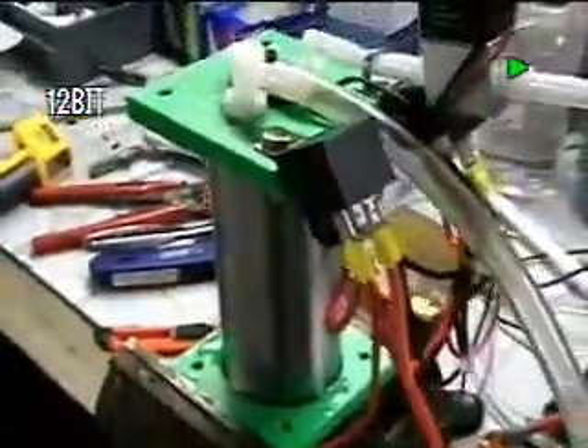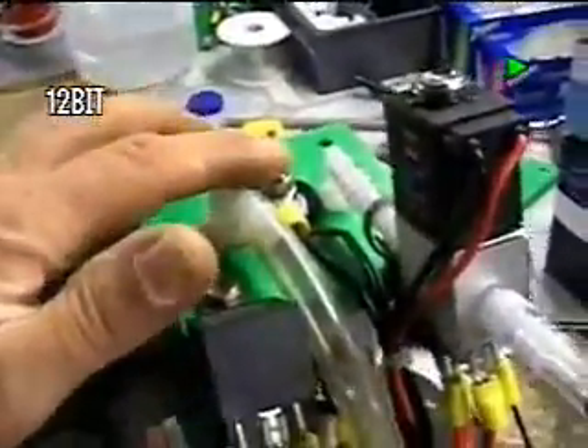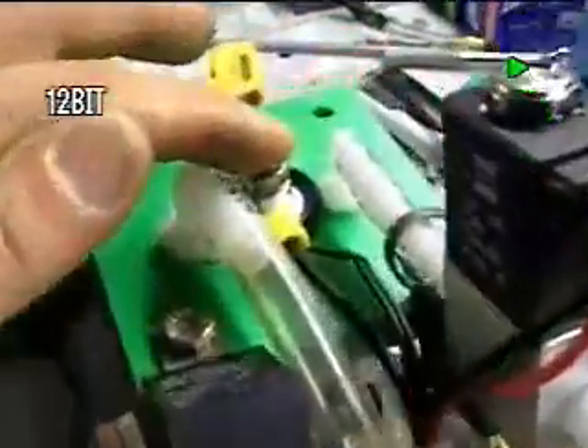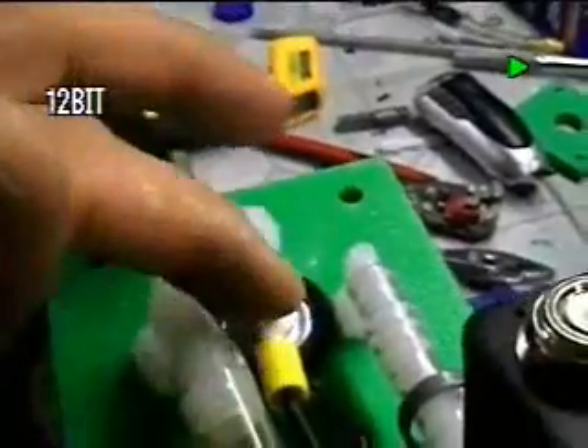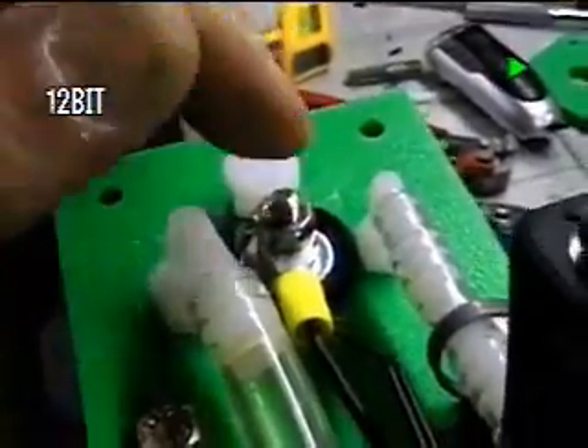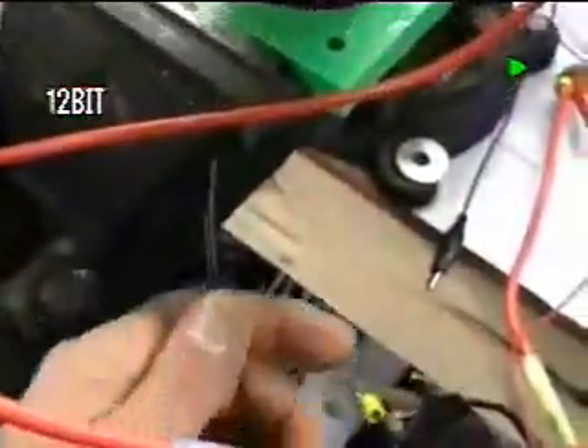And that is the Series 9B. Looks very much like the Series 9, except now it's all center controlled. The cathode is in the center, the anode is still on the side, down here. And now we pull the whole thing together with one center bolt, instead of the four around the outside. That center bolt also serves as it goes through the center, through the cathode, and it also serves to clamp the unit together, and it also serves as the entire ground, which comes out down here. And of course, it's connected to the power supply right there. Our main voltage comes in and feeds it right here, and that of course is over to the red alligator clip off of the generator.